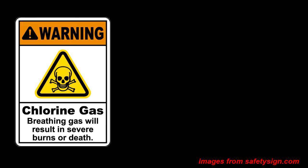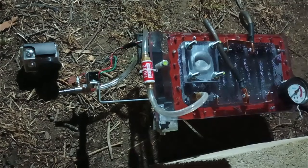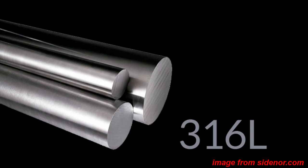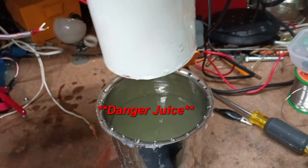This still seemed better than salt, which produces chlorine gas, or the best performing electrolytes such as caustic lye or sulfuric acid, which can cause severe chemical burns. To make electrolysis work for more than a few seconds, the electrodes need to be very corrosion resistant, especially on the anode. For all the designs tested, I used 316L stainless steel for the electrodes. It is fairly cost effective and holds up reasonably well in an alkaline electrolyte solution. However, after prolonged use, it can still release metals into the electrolyte.